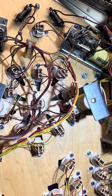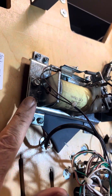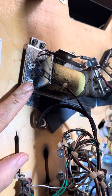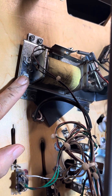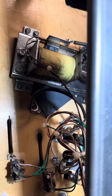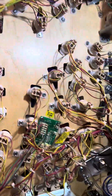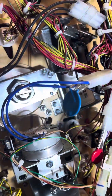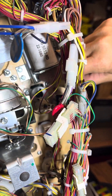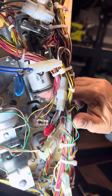The next part of this problem is that the two attaching screws for the coil stop have a tendency for the heads to shear off, and this happens during gameplay. There is no specific game count or anything like that — the number of plays is really insignificant. It could happen to a brand new game or it can happen to a game that is several years old.